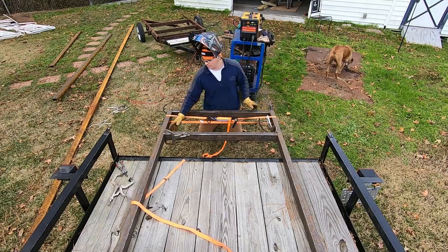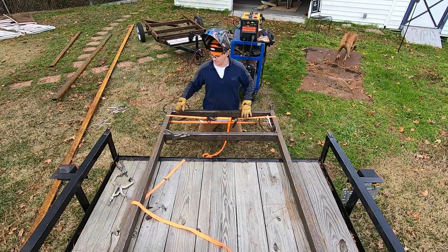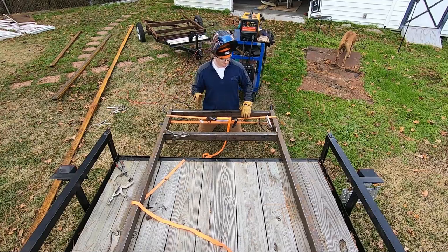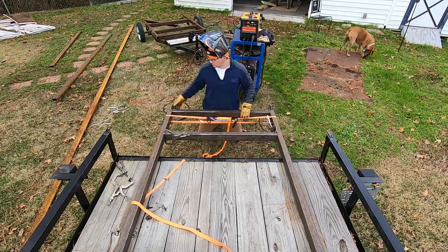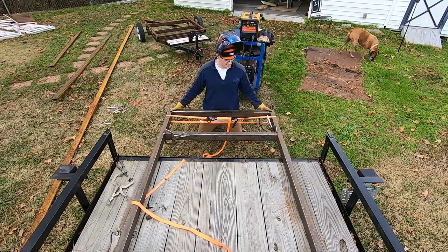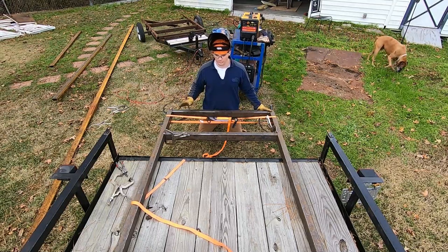And you also notice that I don't put any tacks in the corners here. I really, really try not to put tacks in the corners because they're always a pain in the butt to get to. And if you add more and more stuff on, the spaces get tighter. And it's harder to get in there to break those tacks, but I really want to put more tacks on here to ensure that when I move this, nothing's gonna move.